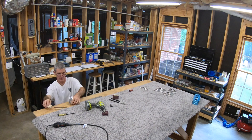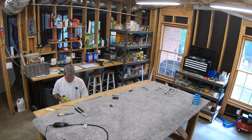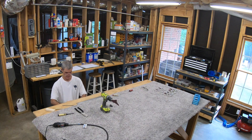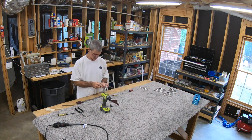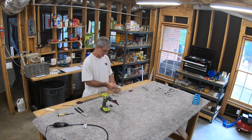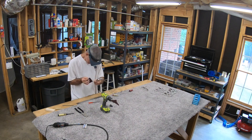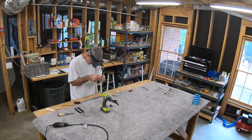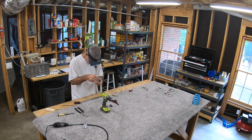I'm checking to make sure the flanges are 90 degrees and bending them to 90 degrees, doing a little fluting and some deburring. Now here I am working on those notches between the ribs with a little file. The idea is you want to round off any sharp edges so that it doesn't create faceting of the skins where they're stretched over the ribs.